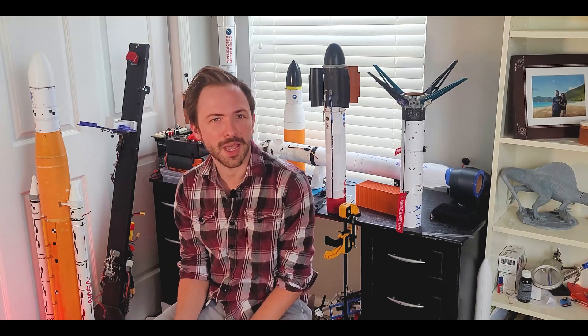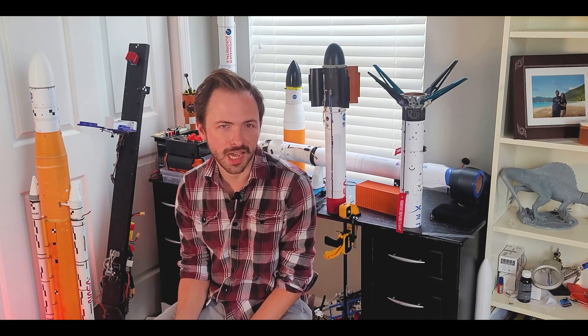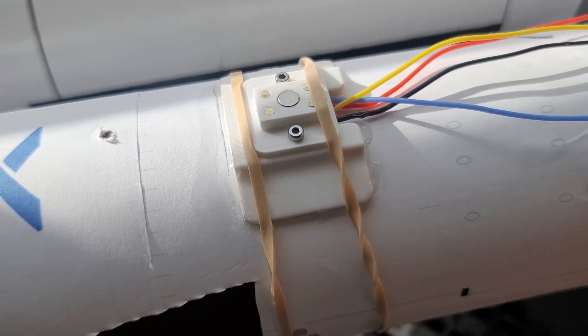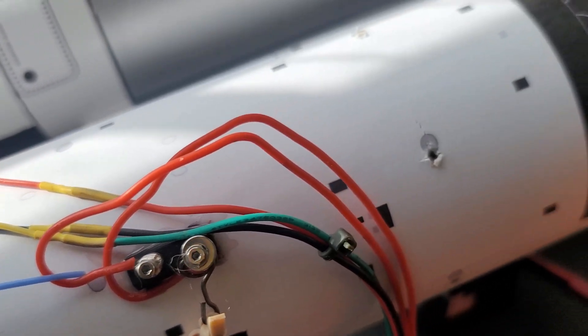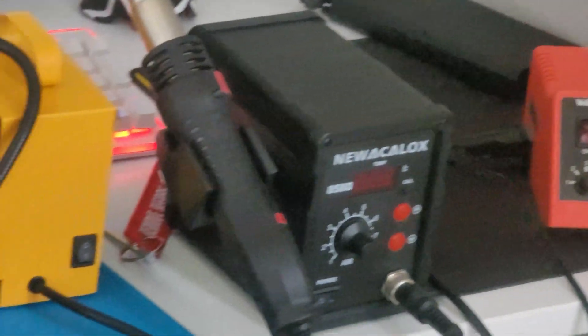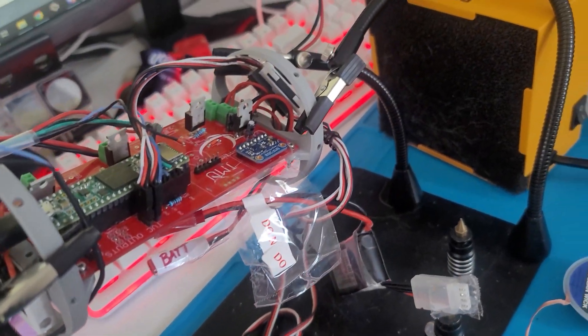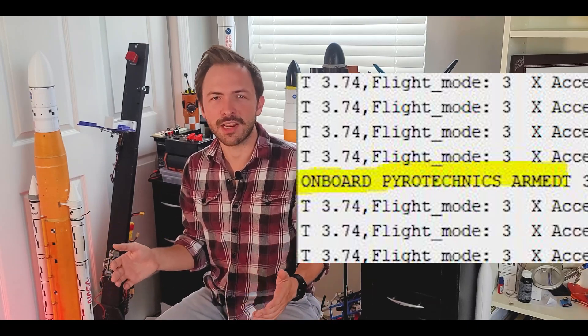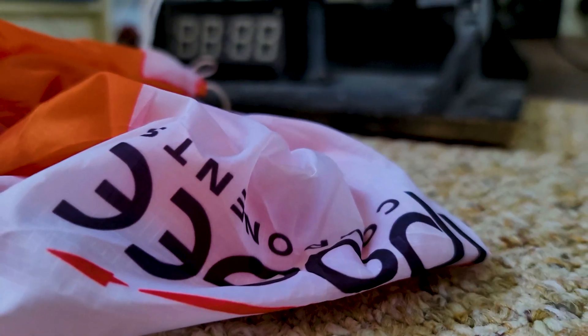At the same time, it meant we crunched another tube on the aft section. I also managed to damage one of the IMUs on board — thankfully I have spares. I was able to use most of the spare parts on hand to get ready to fly quickly once more. It turns out all I had to change in software was uncomment the sensor reading for the barometer. In my extensive hardware-in-the-loop testing battery, I had removed the line of code that reads the barometer and told the rocket to read the testing functions instead. While really minor, this makes the whole launch vehicle unable to do its job — it can't tell how high it is, can't trigger events, and just remains in safe inerted mode. But it will ascend and control, so I did get great data on controllability.